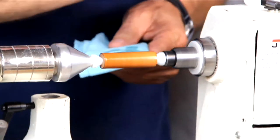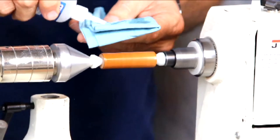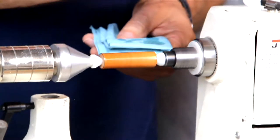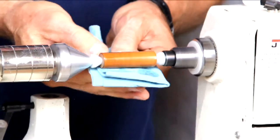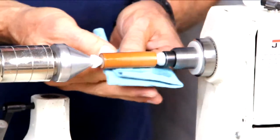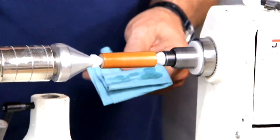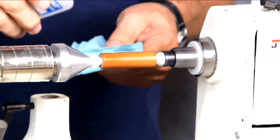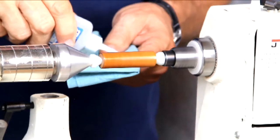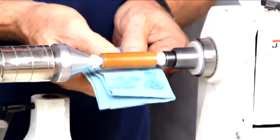How many coats do you need to put on? Five or six. You're slowly building the thickness up, and that's because we aren't sanding between coats — but when we get to the end we'll sand and then polish, and we need enough thickness to allow us to do that. It looks like you're only using one drop. That's pretty much what it is — just a very small amount each time.